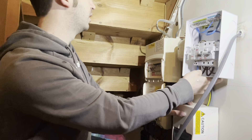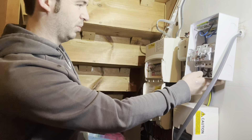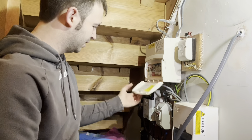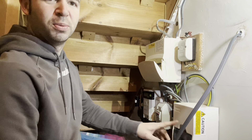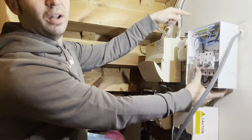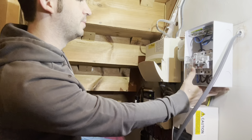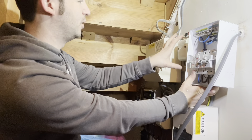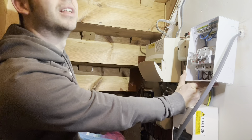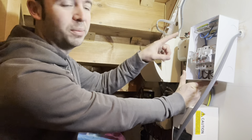There's going to be two 6mm cables - shower number one coming in, and the supply going to the bottom. It's quite busy down below with the isolator, the meter, the bonding, and a second fuseboard, so I might come in the top and run along from this board down with two 6mm cables. I thought about doing conduit between them but it's too busy - there's a transformer there, so I'll use stuffing glands.